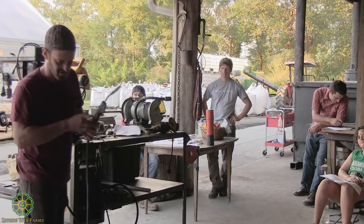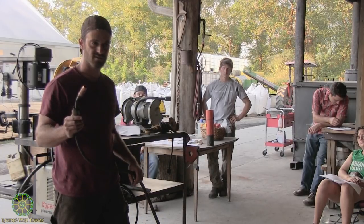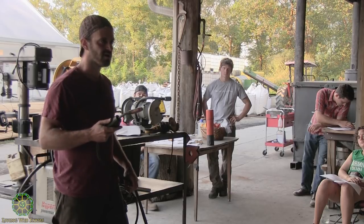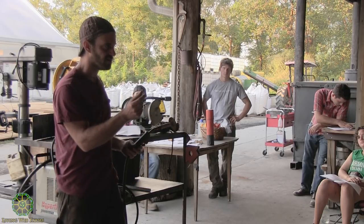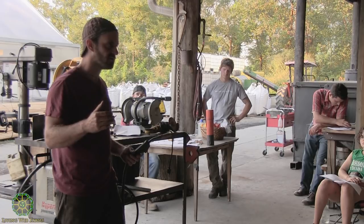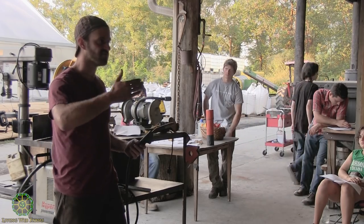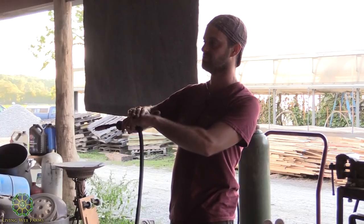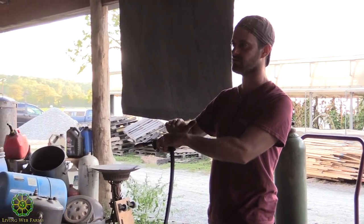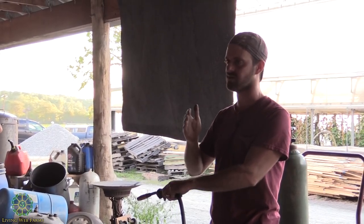So this, again, our little cheapo welder, is the flux core welder. Did y'all understand what Evan was talking about with flux? Do you know what flux does? It creates that shielded environment where your superheated metal does not see oxygen. It's kind of hard to believe, but it actually rusts. It's almost instantaneous how fast it would rust, or scale over. Scaling is a function of rusting, a really thin layer of burnt steel. I'm not totally positive that's burnt steel, but it looks like it. I'll show you. It puts a thin layer of that over the top of what you're welding, and you're not actually penetrating that burnt area of steel.